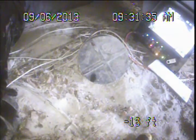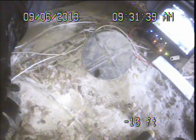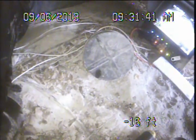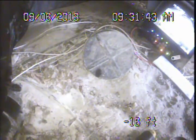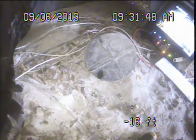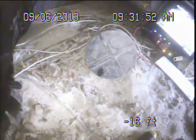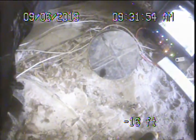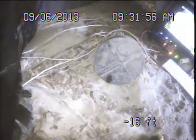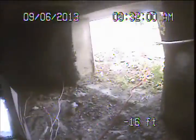I wasn't able to locate an exposed or accessible main sewer line clean out. A main sewer line clean out is an area outside the structure that has a removable cap, allowing access into the main sewer line as the drain system exits the structure. In this case, the main clean out has been covered by the landscaping, so what I've found is this three-inch clean out underneath the building just inside the sub-area access.